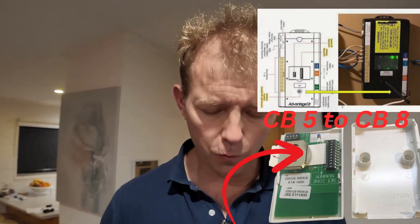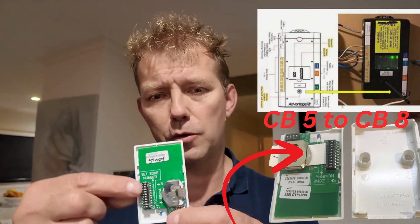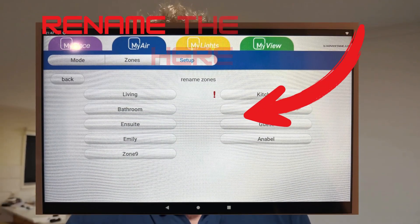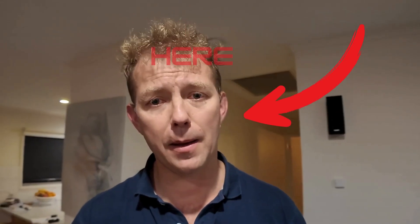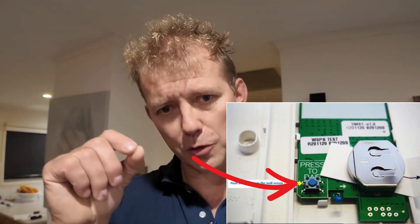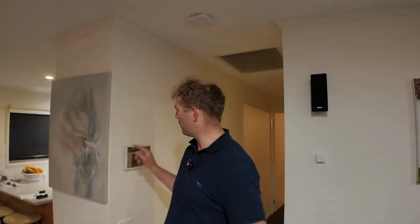Let me show you how to do this — it's going to save you a lot of headaches. On some of the earlier control boxes, the wall sensors are what they call dip switch style, where they have dip switches numbered one to ten. That actually shows you what zone and what room it is — you just walk into the room, for example the lounge room might be zone one. But the later models, the wall sensors are actually press button style. So unless the installer had done the right thing and written down the zone name and zone number, you're going to find it really hard to work out what zone they were.